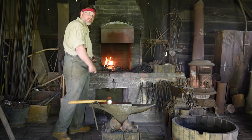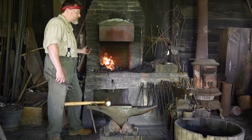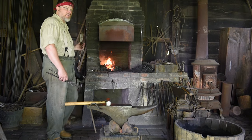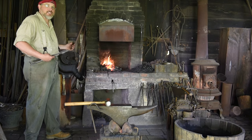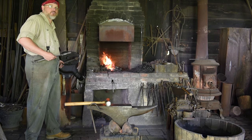I have a coal fire burning in my forge. We use a forge-grade coal, and on its own it gets pretty hot. But it doesn't quite get hot enough for my purposes. I want to get the steel extremely hot — I need to get it up somewhere in the vicinity of about 2,000 degrees.